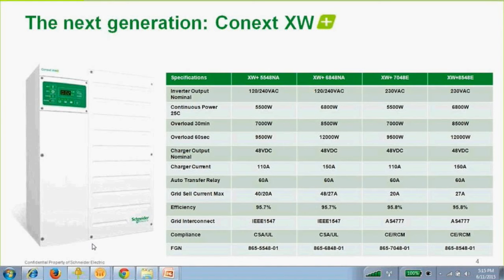So the grid sell current, so this is a grid tie capable inverter. You'll notice here that we have two numbers for the North America models, 40 amps and 20 amps. And that is because the US or the UL models come pre-configured, wired, and programmed as a 120-240 split phase unit, as is our grid. But you can program them and do some reconfiguring inside, very simple, to make it a 120 only unit. And the purpose for that is not so much to run 120 loads, but in order to stack them for three phase, 120-208, which would take three inverters wired in what I call series with a common neutral, so it's a Y configuration